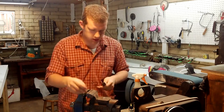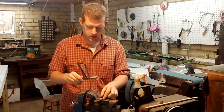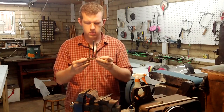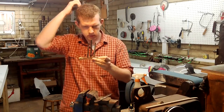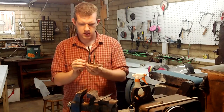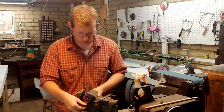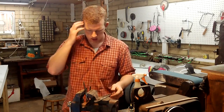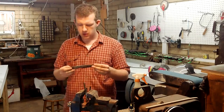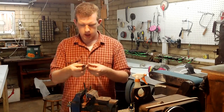We're going to need to put force on it and heat at the same time. And so what we're going to do is use this jig here. It's really high tech. It's just a piece of wood, 3 holes drilled in it, and 3 steel rods. We're just going to place it in our vise and use this to put pressure on our warp. Now, you could have used this to get the warp out of the steel for the heat treat as well. That's fine, it's a little more controlled.